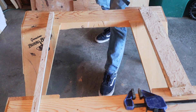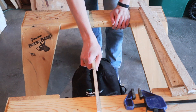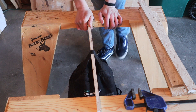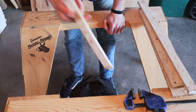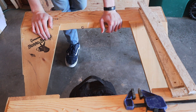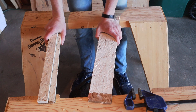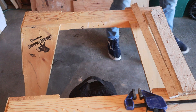And last but not least, one inch — one inch can support one brick, but it's a little iffy. Just so you know, this is 24 inches, and that's the length of section one. Let's try it with two bricks. One inch is out of the question because it just broke as I was talking. I'm using these to get a super rough estimate and then going over to the plywood and doing a second test. So 3.5 inches is obviously strong enough — let's do our second test with two bricks and figure it out.